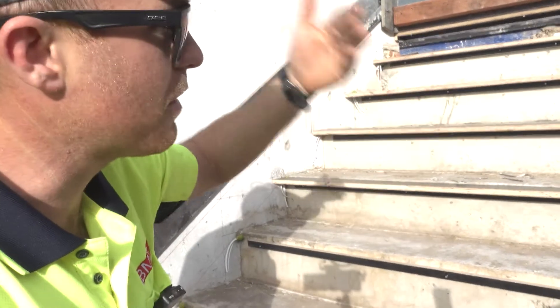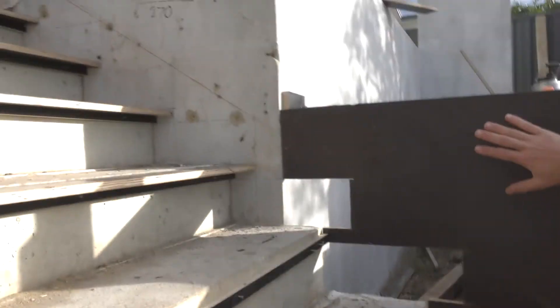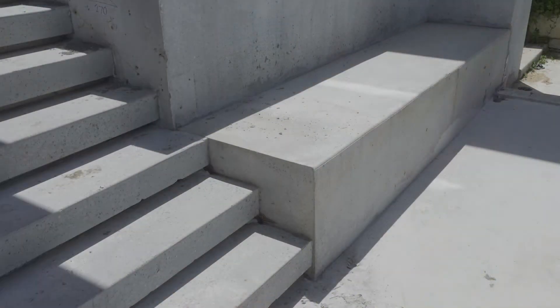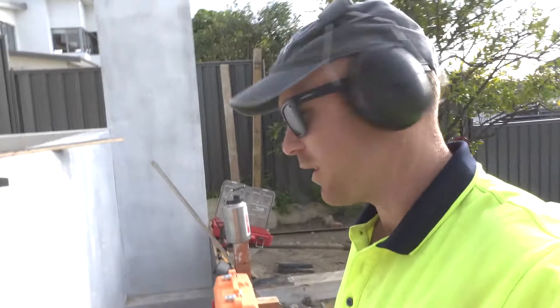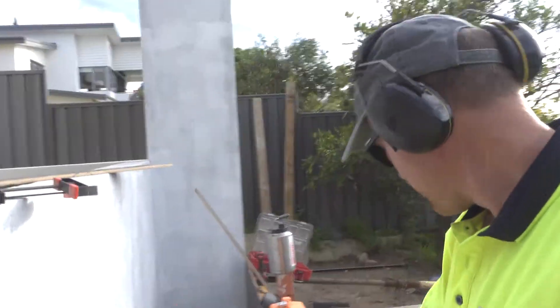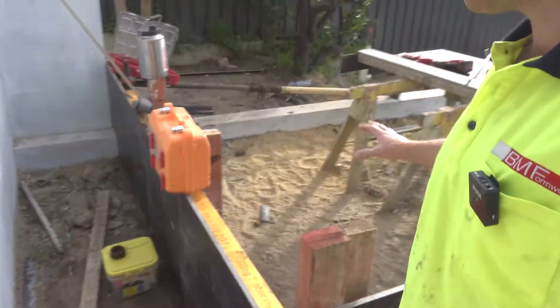So where I'm at now, I've just got to cut my risers, put them in, and screw them on. And then on this side we've got this fancy piece here. This is an edge board — we've got a concrete seat here, so that's going to be mass concrete. And as this is going to be a honed concrete, they're going to vibrate it so there's no air bubbles. So there's going to be a lot of hydraulic pressure — it's going to want to push. So I'm going to put a lot of props on that and it's going to be really strong.